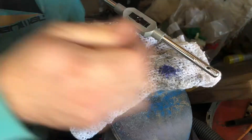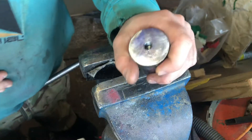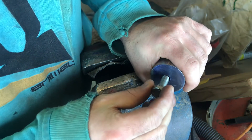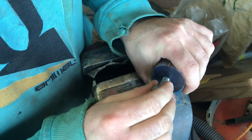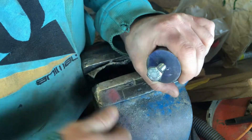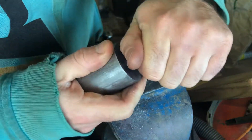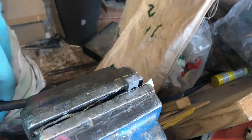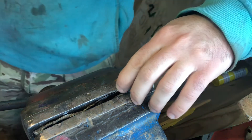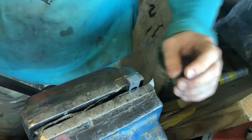I'm going in with the second tap because the first one just had too much of a lead and it didn't engage any threads. I've got just an M10 bolt here and there is no play in that - delightful. I'm just going to try and split this one with a hand saw, just for a laugh, see if I can get it done.